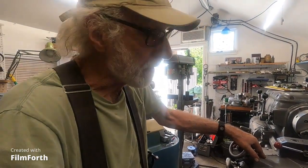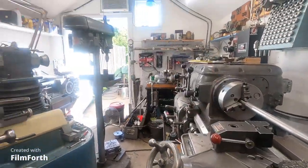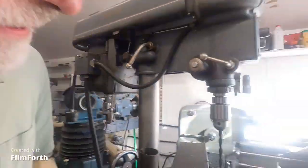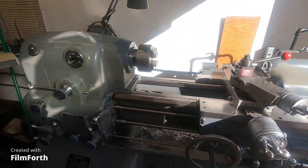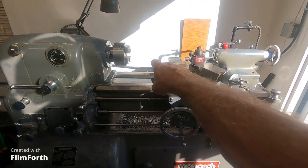One of the tricks around an old machine - but there's still a lot of life left in old machines. Turning up a straight piece gets really expensive for a machine to be able to absolutely turn straight. That piece is about 15 inches long; on this machine I can turn that 15-inch piece within two ten-thousandths. I'm not saying you can - I can do it.